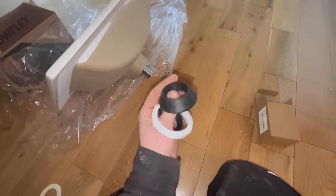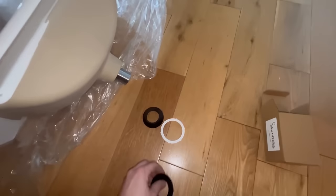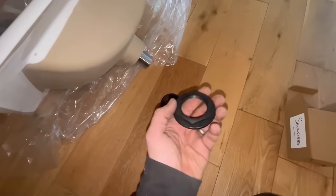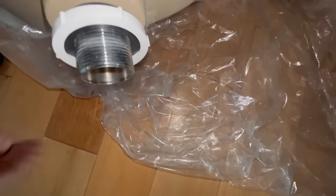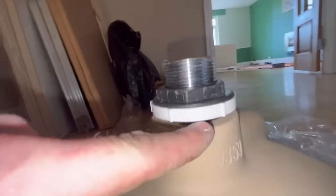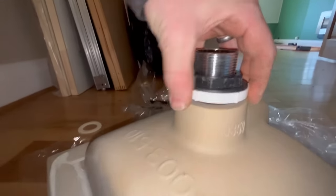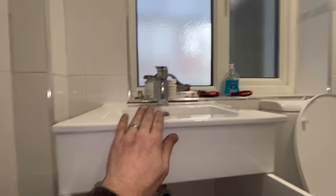We're going to fit the waste and taps first before fitting the sink in place. The seals that come with it — you don't need them. What I'm fitting is the Thomas Dudley basin mate, a really good bit of kit. You put the cone-shaped piece up onto the waste, then your collar, then you nut it — I've never had one leak. Get the collar on, nut it up. That should give you a really nice, well-compressed seal — you can see all the big diamonds are compressed in there.